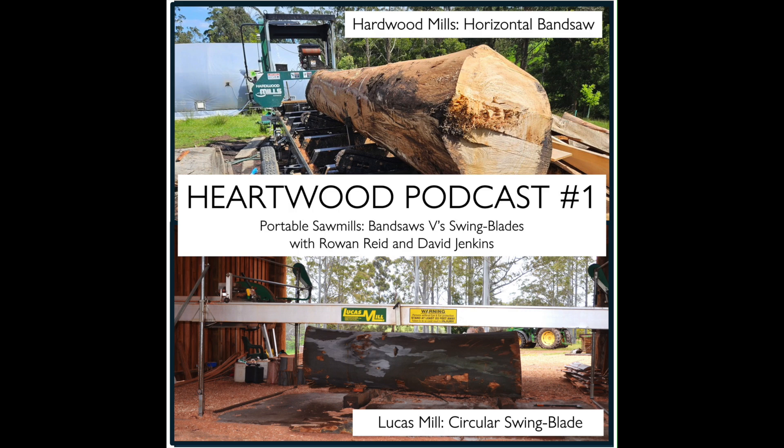When choosing a mill, you really have to start with what you're milling and how big those logs are going to get. Rowan was looking for a mill that would cut from quite small diameter up to large. The GT40 — 40 inches is the maximum — doesn't mean the width of cut is 40 inches; it means you can get a 40-inch log on there and start cutting. He has got up to a metre on it, but it's very heavy work. The bandsaw mill wouldn't be able to mill the log they're looking at — that's one example where one mill can't do what the other can.